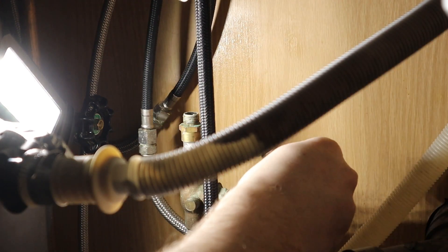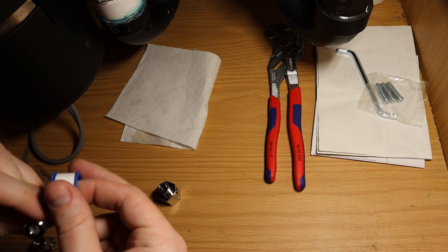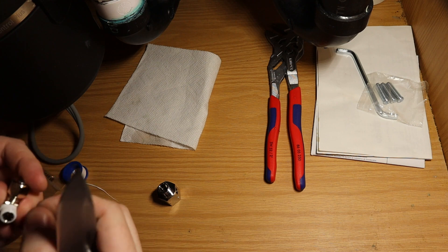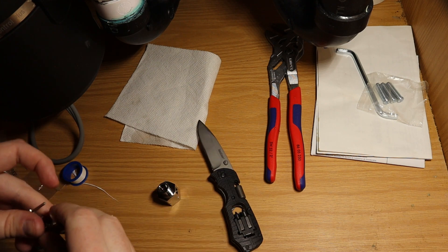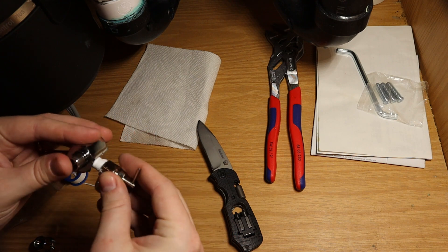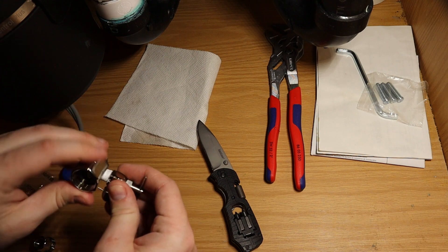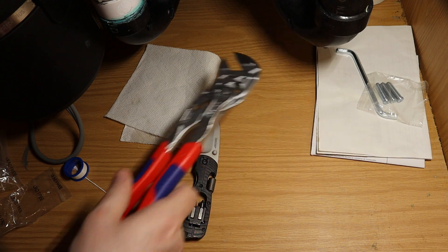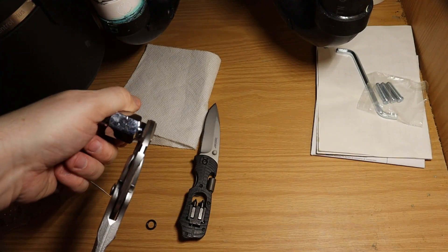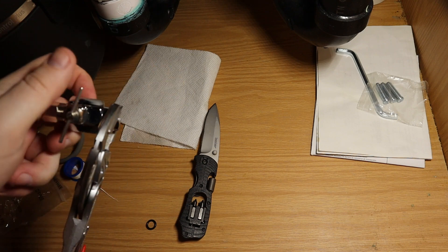Here I've just loosened the hose off the water supply to the sink because we're going to put in a T. This kit comes with two separate connections — either half inch or three eighths — so it's pretty adaptable to whichever supply you have for your existing sink. In this case I'm going with a three-eighths connection. I applied Teflon tape and I'm screwing the stems together. This will basically tee off your existing water supply so that when you put everything back in place, you still have your threaded connection, just moved up to tee off for the new shutoff valve for your water supply tap on the sink.